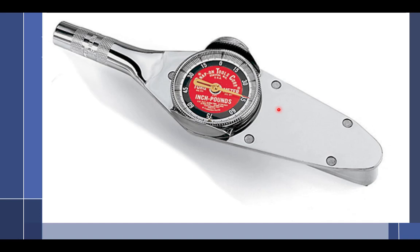Okay, so I'd use that same machine we have. I'd have a chart, a piece of paper, with all the settings. So like this one, I would do it at 5 inch pounds, 10, 15, 20, 25, 30. I would do it in all these increments. You would bring the torque wrench to that setting and see what the big dial read. Then you would write it on this card, and it would go back with the torque wrench. So like 5 inch pounds would be 5.5. It'd show the user how far off it is, because it's rare that torque wrenches are absolutely perfect through the whole range. There's usually a margin of error in them.